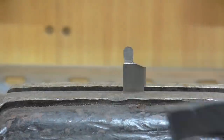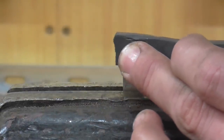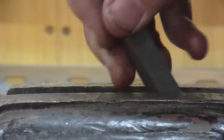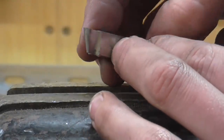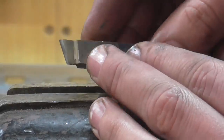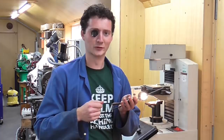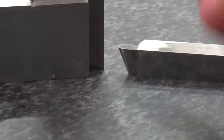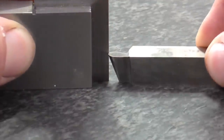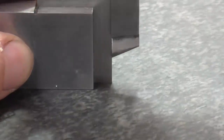When stoning the top rake like that, I just apply pressure with one finger and that aligns the stone for you, and then you can maintain the same angle. That's about it — I'm not going to go much further with that. For a round nose tool done by hand, that's fine. Now I keep talking about rake angles — but what is a rake angle? To put this simply, have a look at the cutting edge around the top of this tool and consider how it interacts with my square. Wherever I hold it against the square there is clearance around the sides, and this is what allows the tool to cut.